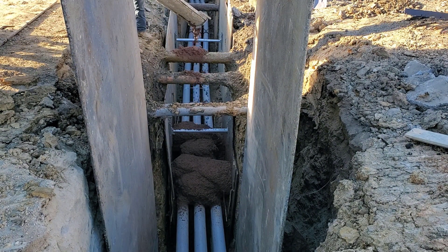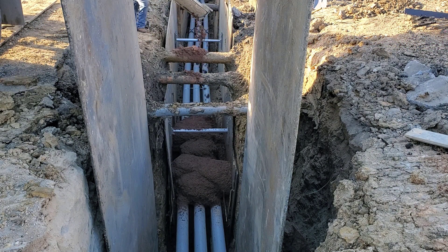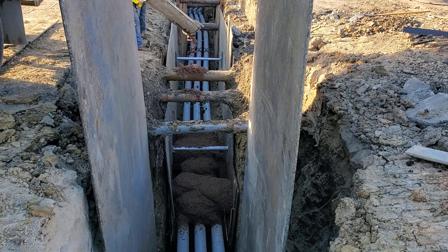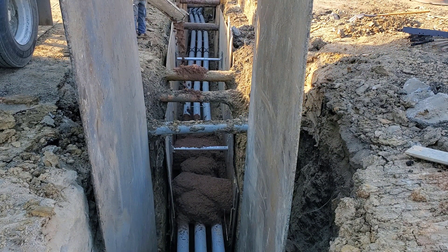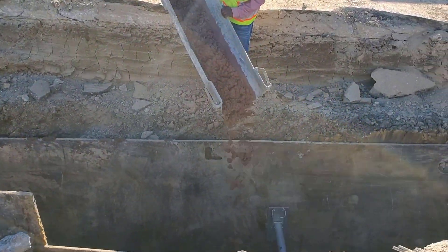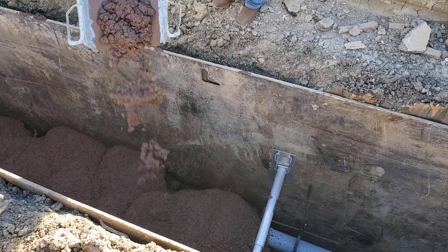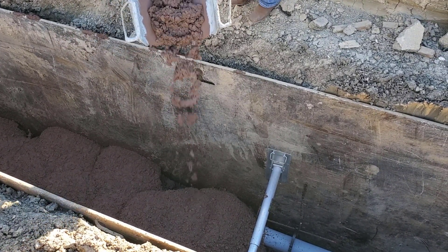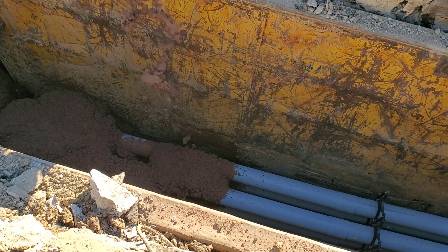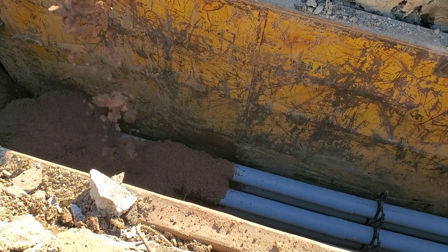As you can see, the concrete has more of a burgundy color. The red concrete is required backfill for all electrical conduits. In the future, if a contractor excavates here, they will see the colored concrete and know there is a buried electrical conduit here. The concrete is required to cover all the conduits and have a final fill of 12 inches above the top of the conduits.